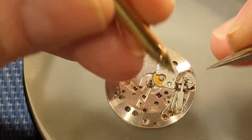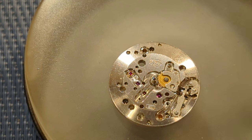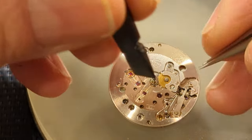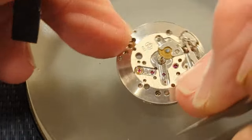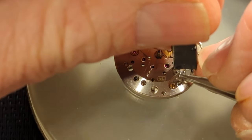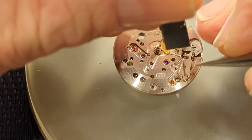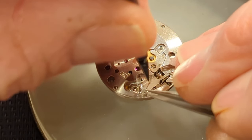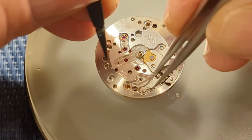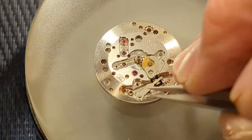Now I've got to take this part off. Right now I would have the loupe really close and I'd know what I'm doing, but this is just — pull out the brass stick there. I'm missing all the parts I'm trying to disconnect. Oh, there we go, that came out. Now what am I doing? I know there's a spring there — there's the setting lever — and I don't want to lose the spring, because fellow watchmakers and repair people, you know what it's like to try to find these springs on the floor when they zip off. These things can go quite a distance when they spring out of the main plate. Here I am trying to loosen that spring up to catch it before it takes off. That actually worked — I'm surprised.